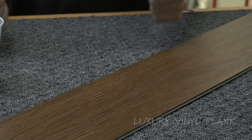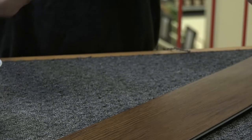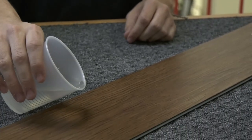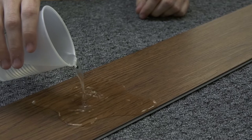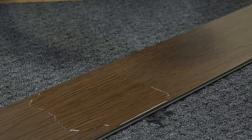This is a luxury vinyl plank that we have as a closeout product at our store. It has a plastic back but very thin click locks, so the top does a good job at resisting water, but as soon as that spill starts going in between the cracks the water could stay there and cause damage underneath the boards. A good place for this product would be in a basement, since they see a lot of moisture and having a product like this would allow that moisture to breathe out. Another good place might be bedrooms that don't see a lot of moisture to begin with.